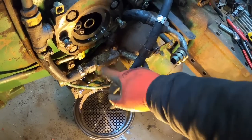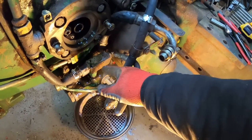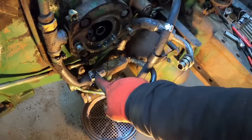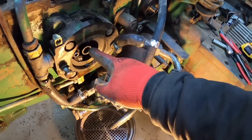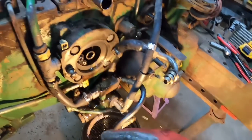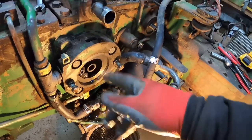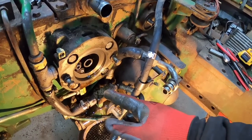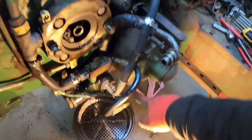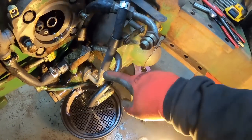And so when you crank it over the next time, there's not enough flow yet, just getting it going, not enough pressure. And so the oil goes through here and up into the cooler, or back to the reservoir if the cooler pump ain't turning fast enough. But they are connected together. Once the tractor fires up, things are spinning faster, the hydraulic pressure comes up, and you got this line, it's coming off the same circuit as the steering is coming off from.